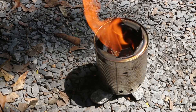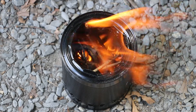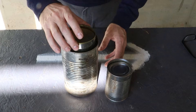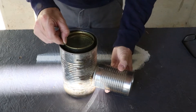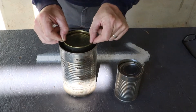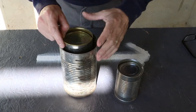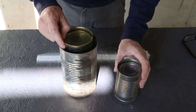I have made a couple of gasifying stoves with soup cans, but I've never tried the rocket stove. I've got several sizes of salvaged cans. My goal is to nest this can inside the larger can and then have this can coming in from the side. I'm going to fill the space between the two cans with some perlite, which will help insulate the riser and allow it to send more heat vertically versus radiating out to the sides. That should make this a little bit more efficient.